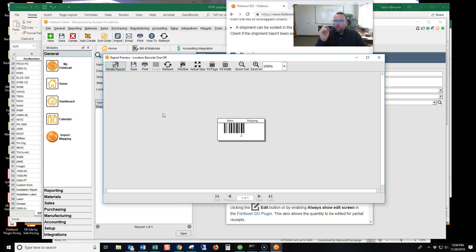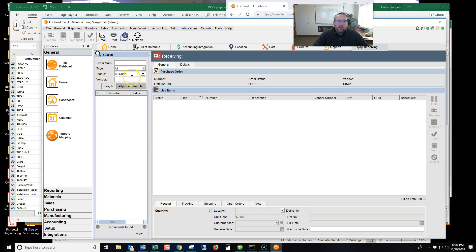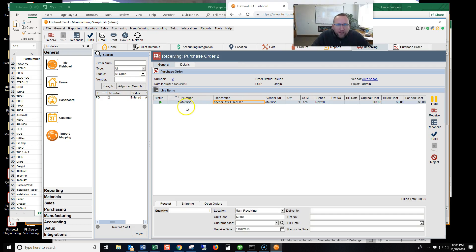So in the barcode world, that's step one. You need barcodes on your locations. You need barcodes on your parts. You need barcodes on your carts, pallet jacks, and forklifts to make it simple and easy to scan. Anytime you move a part, it needs to be scanned — Fishbowl wants to know what part that is. The third element is probably obvious for most people doing barcoding: you're controlling something, and it's usually a lot number or a serial number, especially in the food industry, cosmetics, or anything consumable where you're required to track lot numbers. When you receive in Fishbowl, it requires you to enter a lot number.